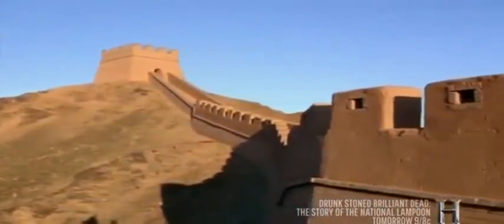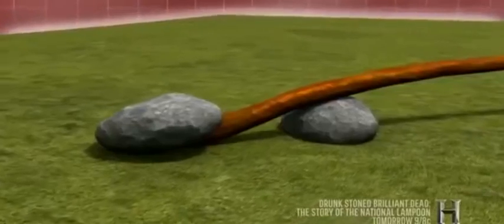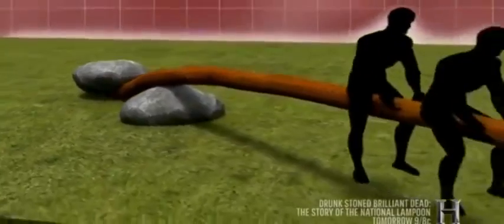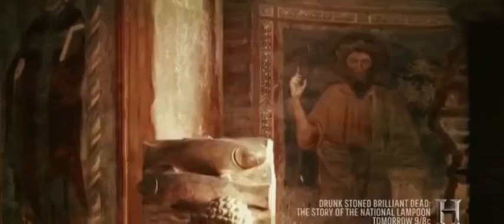The Eads team's drilling rig has come a long way from the earliest well drilling, done in ancient China around 600 BC. They use a method of percussion drilling that they call the spring pole. The spring pole is just simply a branch or a tree itself with a fulcrum, like a teeter-totter. But they put the fulcrum closer to one end so that the other end stuck up high in the air. And then they produce a reciprocating motion that raises and lowers the bit, and that pulverized the formation.